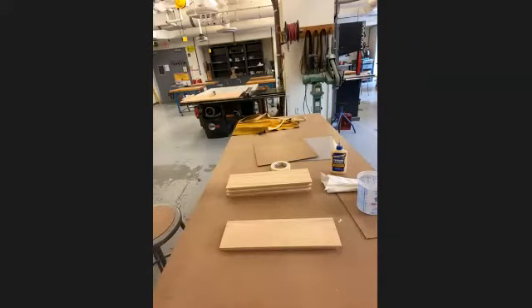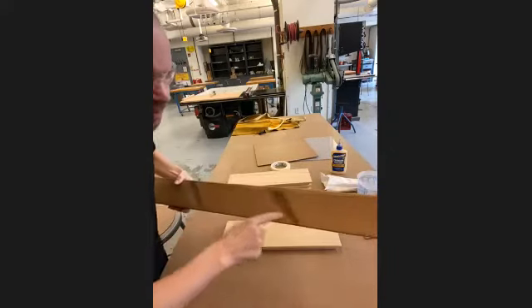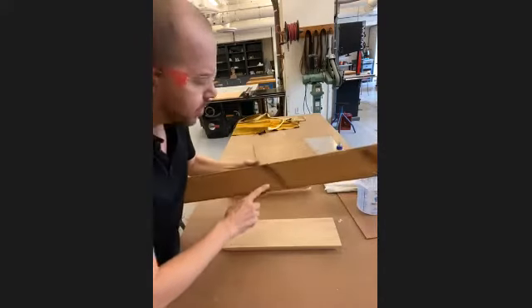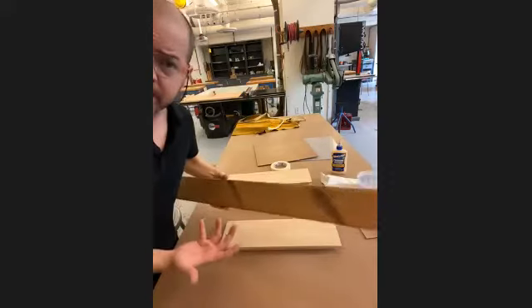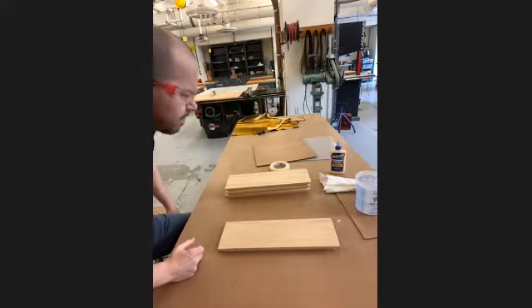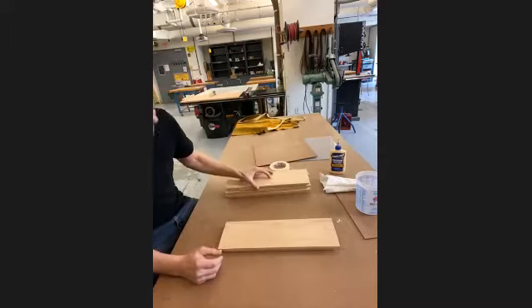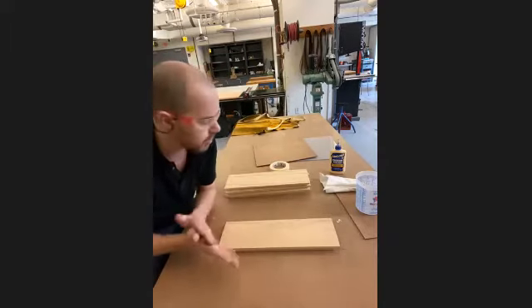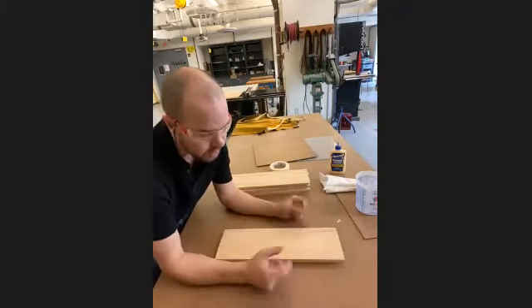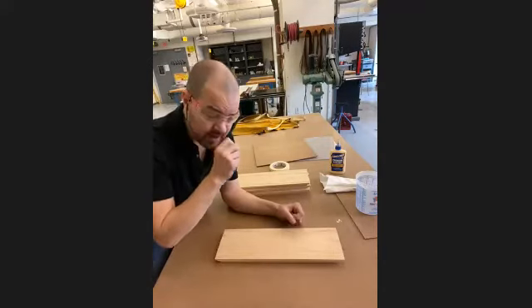Let me pull a piece out for you. In this piece of wood you can see all these dark areas — these are big knots in the pine. While they're often aesthetically pleasing for certain things, they're actually like warts in the wood and weak spots. The wood you guys have has a certain flatness and cleanness to it that you won't get in a lower-quality pine.